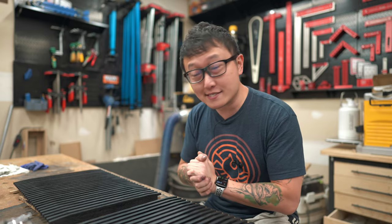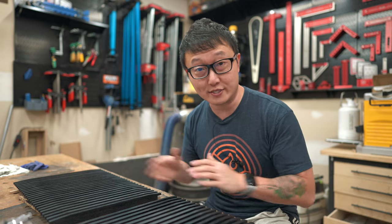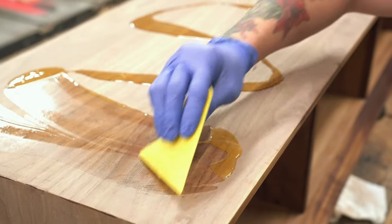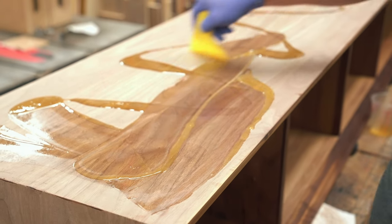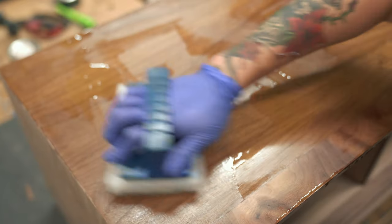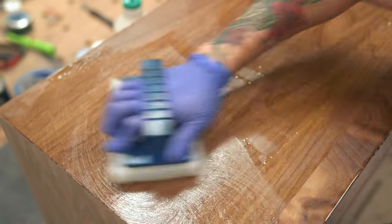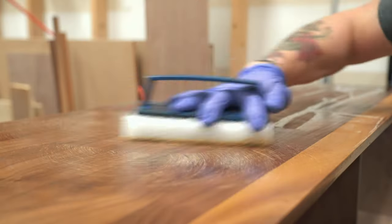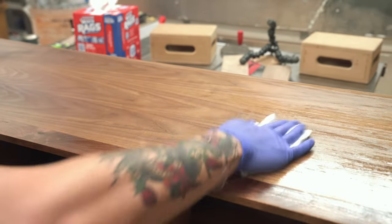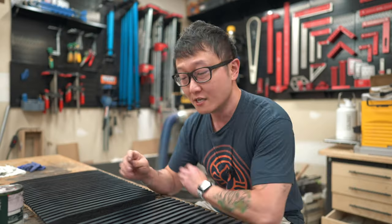When applying the finish for larger pieces, the process starts the same way as with the stain: pour the finish over the surface and use a squeegee to spread it out. We don't want big globs sitting in one spot for too long or it's going to darken the wood in that particular spot. You can see some dark spots forming when I began spreading the finish because I was adjusting the camera, but once I started buffing it with the pad, it was gone. Once the entire surface is covered, let it sit for about 10 minutes to soak in, then come back to wipe it off with rags. And remember — don't apply more finish than what you can do in 10 minutes, so for larger projects always work in sections.